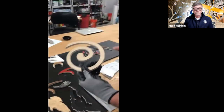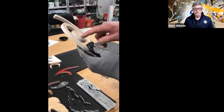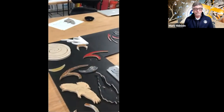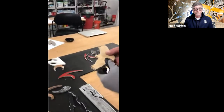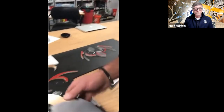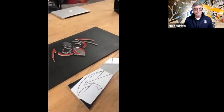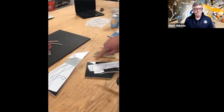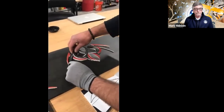You can actually just go round and round, you don't have to back out. Just keep going in a circular motion. This is really a very brittle marble, but once again, you can see it holds very sharp points. This particular porcelain is just awful for chipping, but on the ring saw — very sharp points and very clean edges.